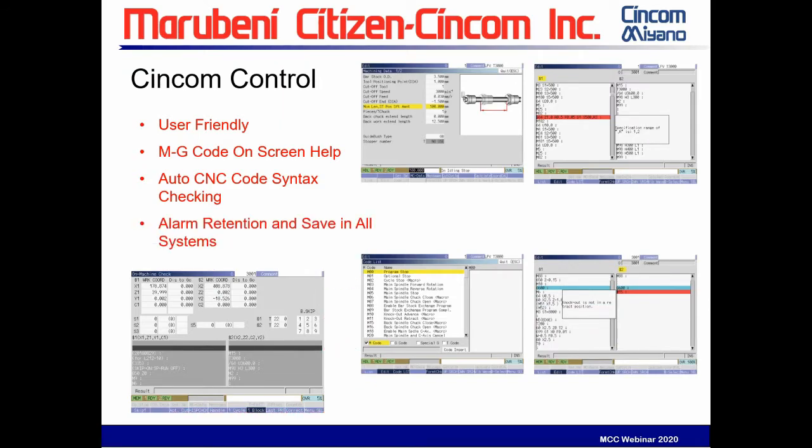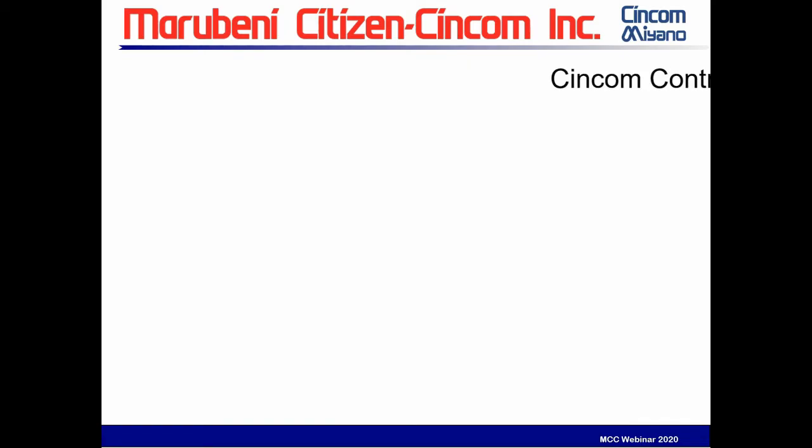Alarm retention and save in all systems. This is a good function if you're doing some editing on the machine or doing some setup and you find these alarms occurred. For example, it's the end of the shift and you haven't had a chance to repair it. You can tell the operator following you what was wrong, and he can go right to the machine, run it through and see exactly where the errors occurred and know what's wrong so he can fix that. So that's a very good feature as far as helping the communication between operators.